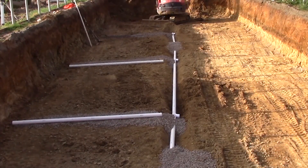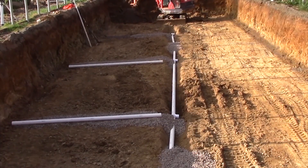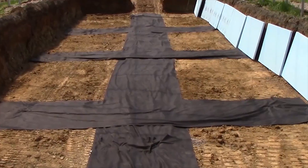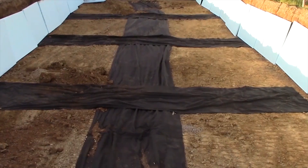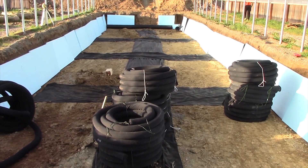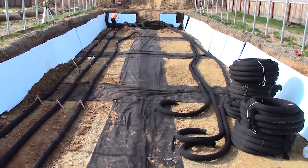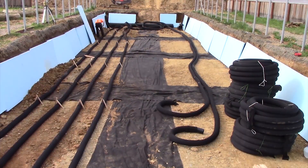You can see the versatility of this equipment and how well it works together inside these compact areas. The ramp is built, cleaning the edges of the banks out. They will install some foam insulation along the sides of these walls to help insulate and keep the heat and coolness in once the system is up and running. Then they'll get some rock and filter fabric over it to keep the dirt out, and tie this system into the existing curtain drain that we dug around the entire perimeter of this project.